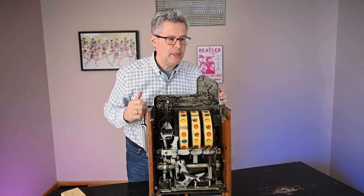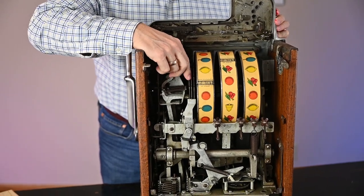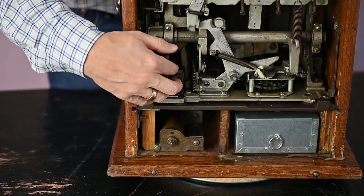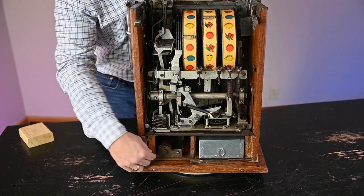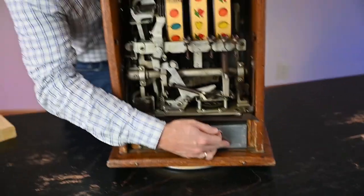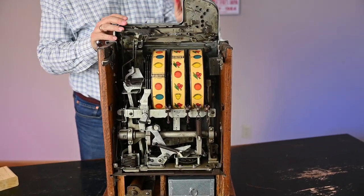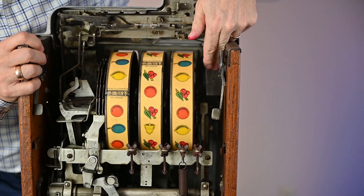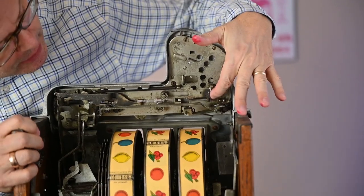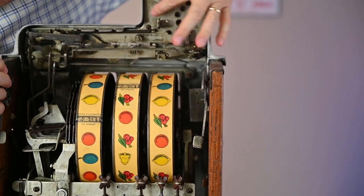I'm going to cover four major components: the coin escalator, the reels themselves with these discs that have holes in them, these payout fingers, and down here are slides that correspond. There's also a pneumatic lever for when you pull the handle that slows the handle down. There's a coin box that holds excess quarters as the machine fills up, and there's also a counterfeit coin box. The counterfeit coin box collects things that are not actual quarters. When you drop a coin in, here's a magnet that detects if it has any kind of iron in it — it will pull it and drop it, so it won't go into the mechanism.